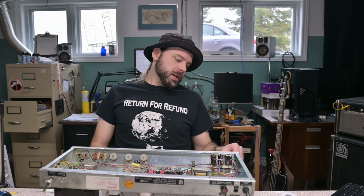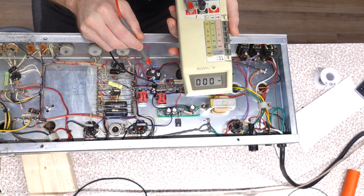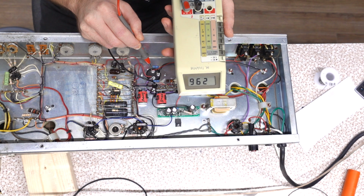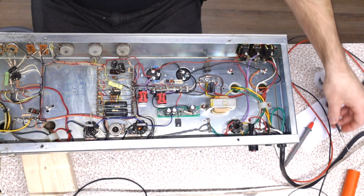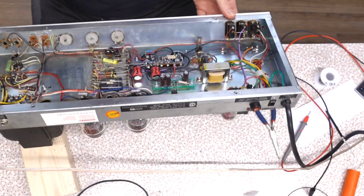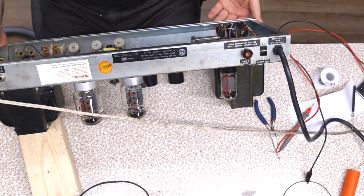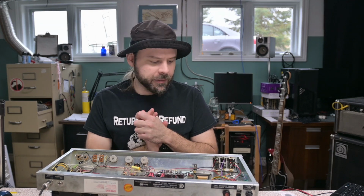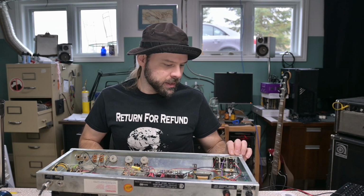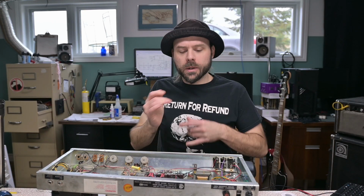So in theory, we turn this on. What's going to start to happen is it's going to start to slowly charge up this guy as the pupper warms up. See? It's pulling through the tube right now, 620 volts. Standby is still currently on, so now in theory, if I flick standby, that tube shouldn't pop on us. Ready for it? And we have sound. There you go. Standby problem should officially be fixed now. We'll test on it again later. We'll go ahead and cool the amp back down, and then we will do our dual rectifications.